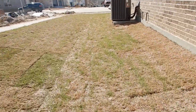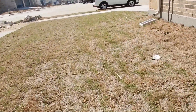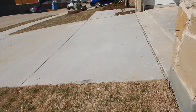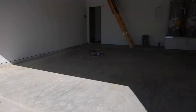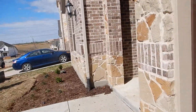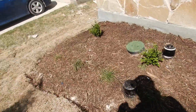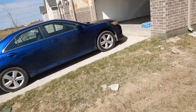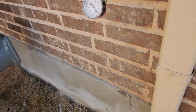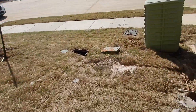So what did we learn? We've got a mysterious irrigation box, our backflow prevention isolation handle cannot be operated 100 percent, and we still have about 65 psi on the water pressure — which is good.